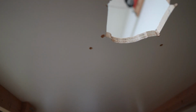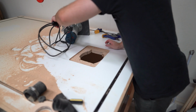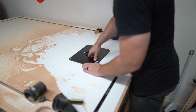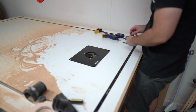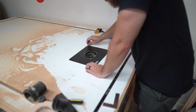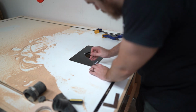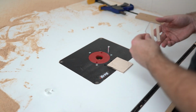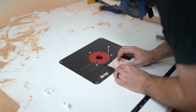And then here it is from below. Again, super ugly. Sorry you guys had to look at this, but here are the threaded inserts from this opposite side. Take note that the thickness of my top is 1.5 inches. It's two 3/4 inch pieces of melamine. But afterwards, I easily screwed the bolts into those threaded inserts and tested it out for level, and it worked really well.